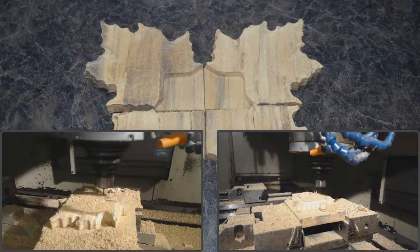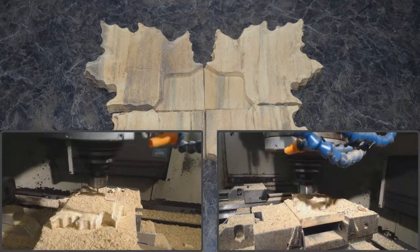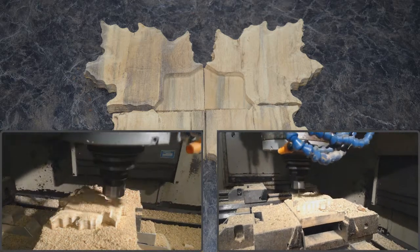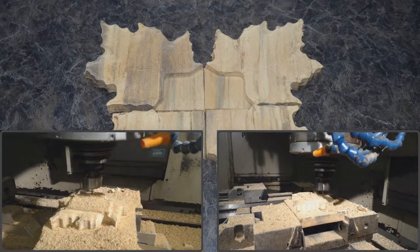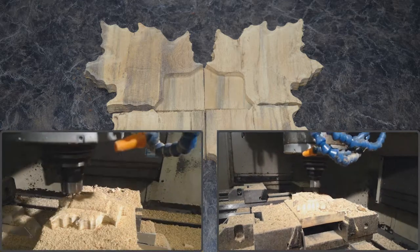These mirroring functions can be found on many CNC machines, and as long as the part is programmed from the XY center, no new setup will be required to make all four mirrored image parts from one program, and is a very handy feature which can save programming time.